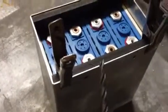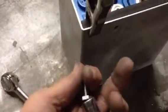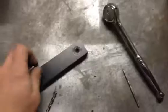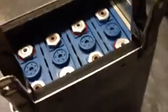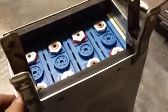I then went through the material with about a 3/16 bit and directly used the 1/4 inch bolt in a drill socket to force threads into the vinyl. And I don't know if the camera's going to pick it up very well, but I was able to get it to hold threads in this and take quite a bit of force before it would spin them out, but even still it'll hold in place. And with this installation, that shouldn't be a problem because we're not really having a lot of force directed against the threads. They're more of pins holding it in place.